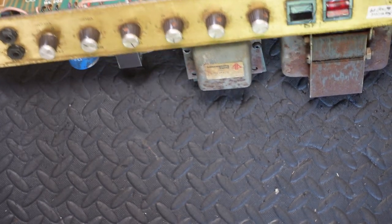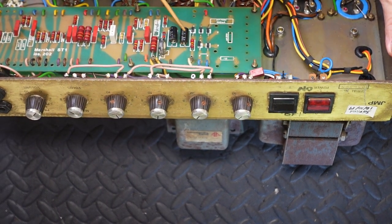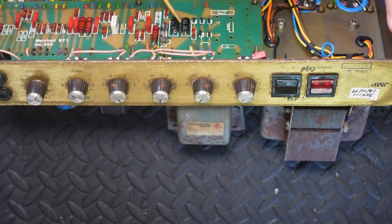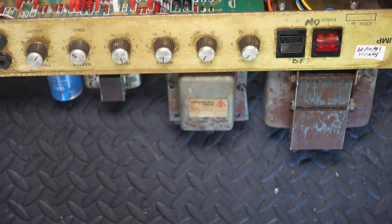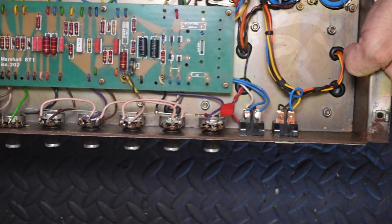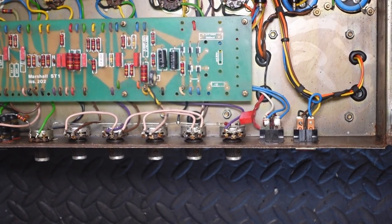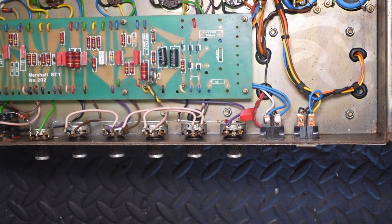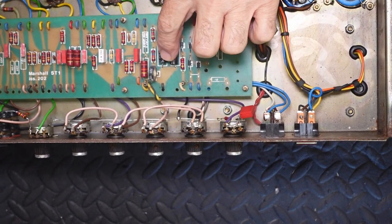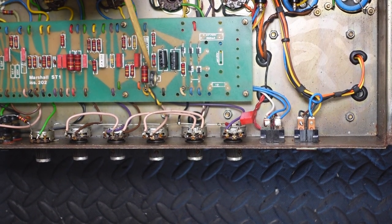except that I can see, I don't know if you can see that, that filter cap there, sorry, the filter cap for the bias circuit is leaking. I don't know if you can see that. Can you see that? There we go. Oh, that's heavy. It's leaking. So in addition to the main filter caps, I'll replace the two bias filter caps. We'll clean out that bias pot.